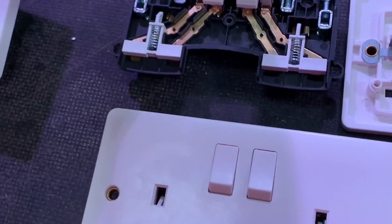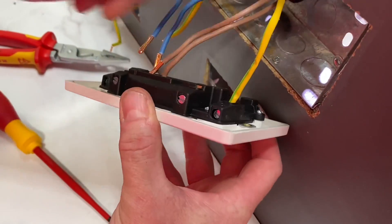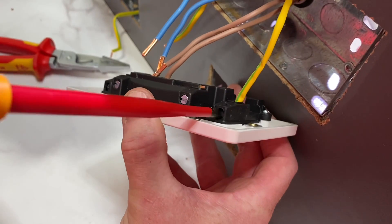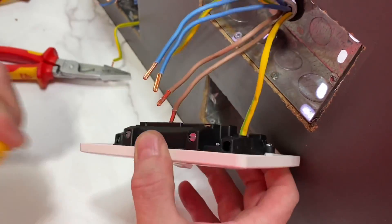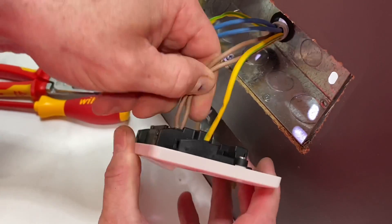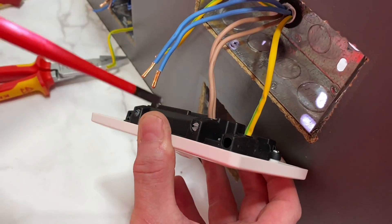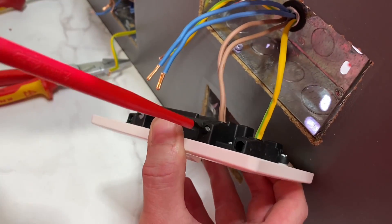Those big terminals - I do love to double my terminations over into a socket outlet, and I love the fact that we've got two CPC connections so I can split those as well. Plenty of room, already backed out in order to get more terminations into that socket outlet. A sensible layout too - they're all at the top of the socket, quite easy to wire into regardless of where you're coming in from.